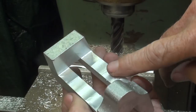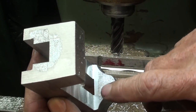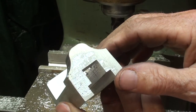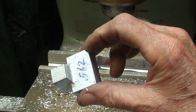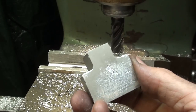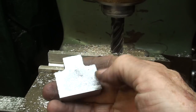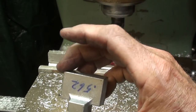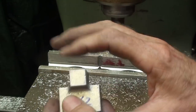That will be the final finish in there — it will not get machined again. This didn't quite clean up, but I didn't really care. A little deburring and now I think I'll have a go at the movable jaw and machine it so that it will fit. This is kind of a funny casting because there's not a true surface on it, other than this side which is fairly clean because I had belt-sanded it. But it still needs a cut — matter of fact everything on here needs a cut, except perhaps this surface where it says 0.562, which is the width right here.